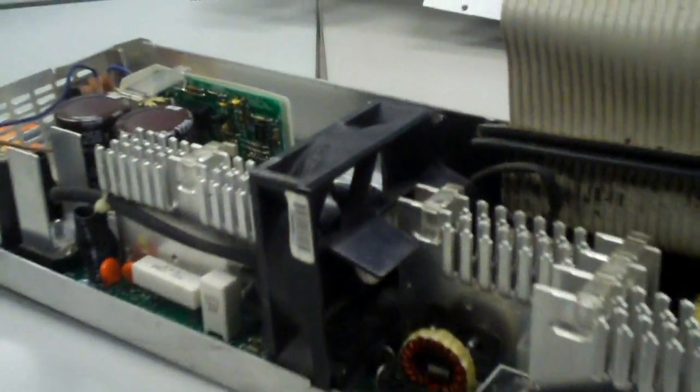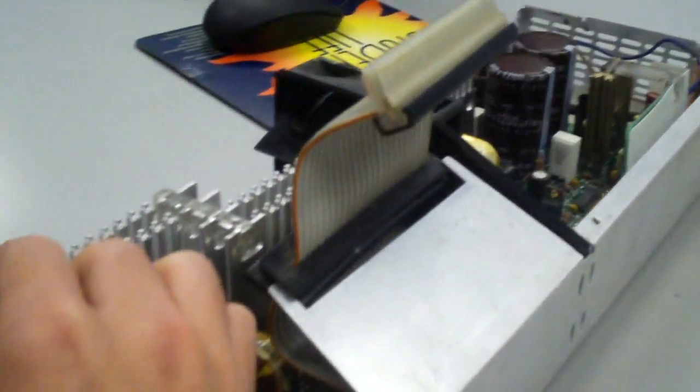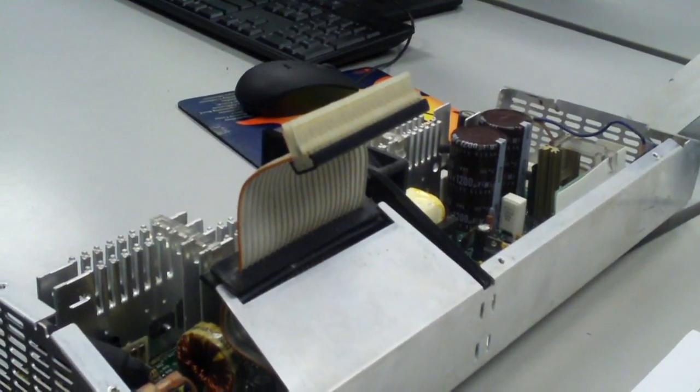I can imagine trying to replace one of those hard drives back in those days — it'd be fun. This thing is built like a monster. Whenever it fires up the hard drives, it spins up four of them and then about a half a second later triggers the other four, so you don't have that really big current pulse — a nice idea. Hard drives do pull a lot of power when they first come on. But yeah, anyways, looking at this power supply — again there's a look at the cover — and thanks for sharing that with me. No problem brother. If you have any questions or comments feel free to ask, and thanks for watching.